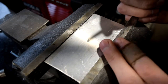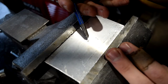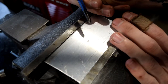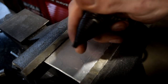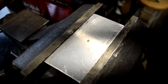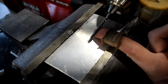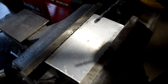Next, mark out your hole. I always recommend punching with a metal punch or a very hard pointy object to put a small divot where you want the hole — this helps your drill not slip on the initial start. Now if you've got a nice fresh step bit you can just go ahead and start drilling, but I typically start with a much smaller twist drill to get a pilot hole going. It just eases the process of getting the step bit started and prevents it from walking.